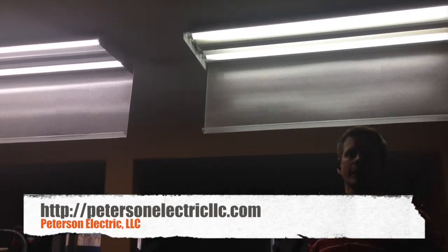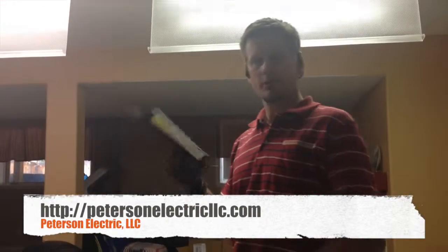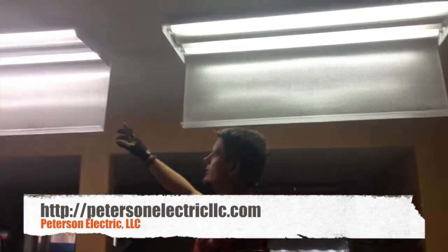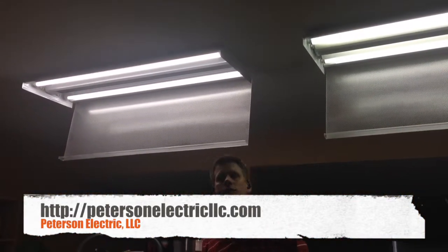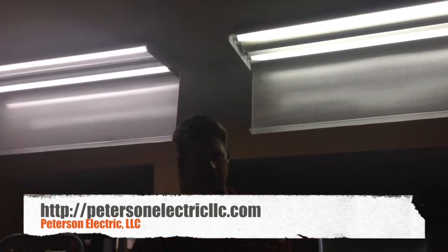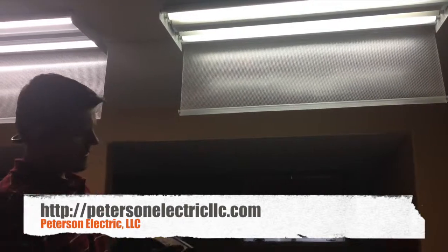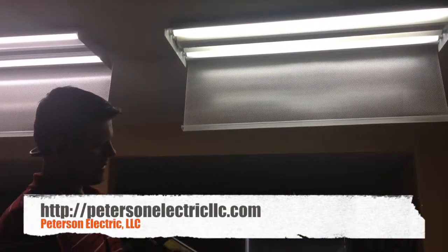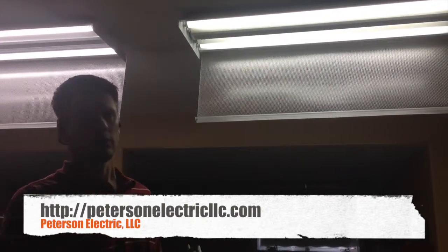This is my last and fifth video on LED. I want to talk about these ballasts again. This is called a magnetic ballast. The newer drivers in these LEDs are just a driver and they're electronic, so you're not dealing with this 5-pound, 10-pound paperweight on some of them. The other thing about these is that if yours are old enough and they say PCBs, you have to dispose of them in a proper manner.